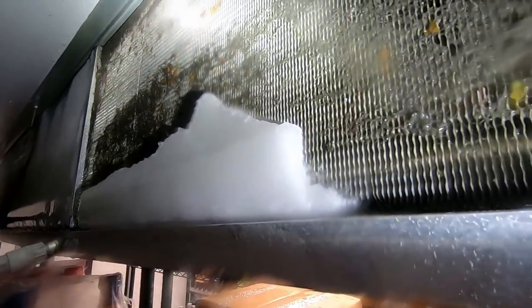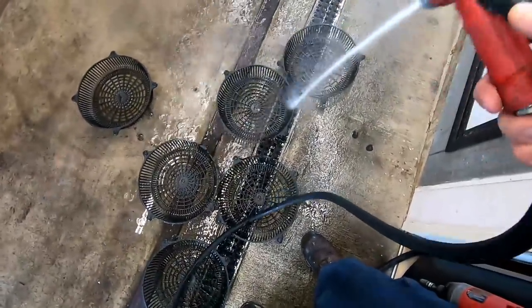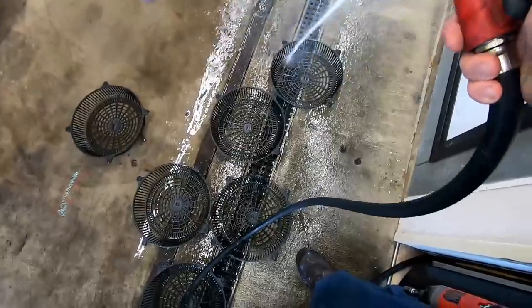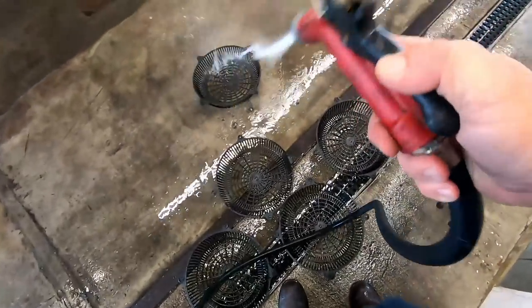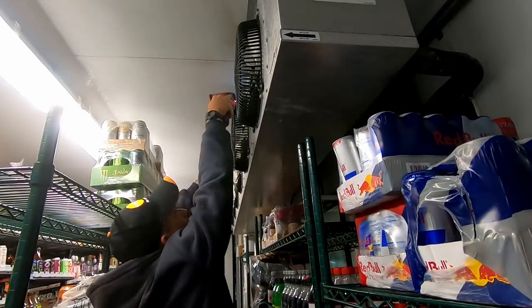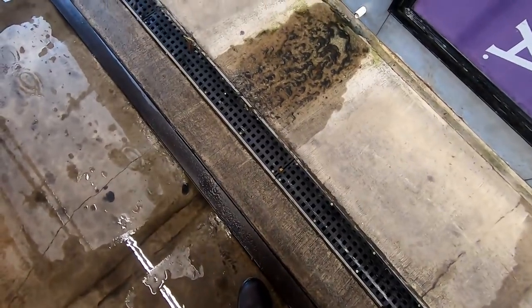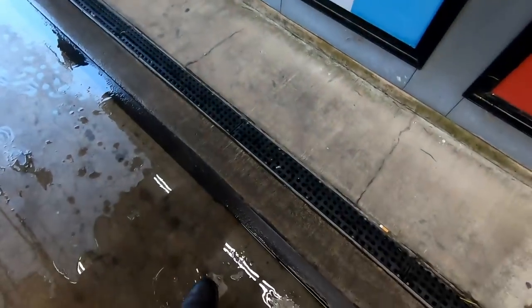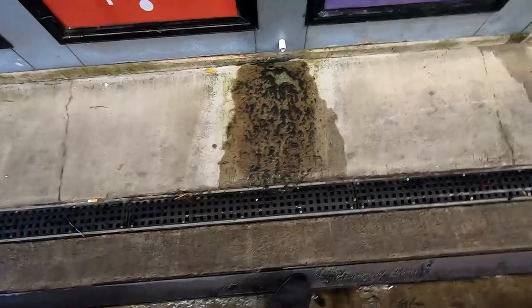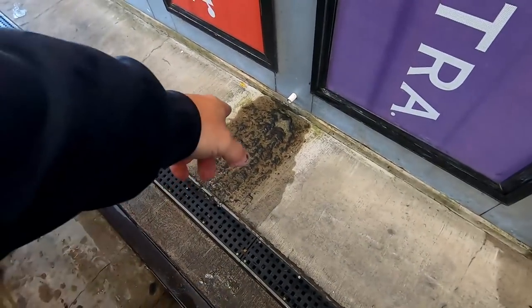While we've got them out here, might as well work these out — it's kind of dirty. Try to get most of it off and get the other side, clean off some of the blades. That wire — yeah, that's so it doesn't freeze up. It's like a heat tape thing running right through the middle of it. It's supposed to be there. This one doesn't have it because this one doesn't run as cold as the other one. But that's the kind of crap that was on the coil — that didn't help it.